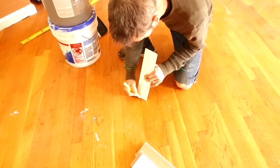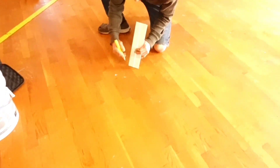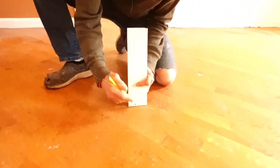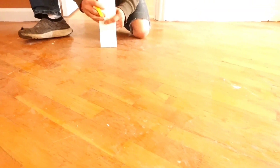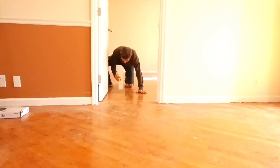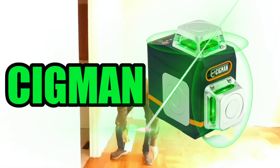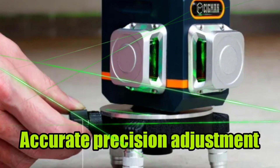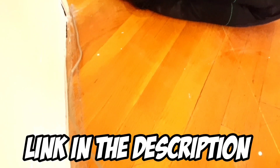I could make a crow's foot at both ends and snap a chalk line, but I don't like using chalk indoors with fresh paint — it tends to get chalk everywhere. And with a distance this long, if you don't pull your line super tight, it can have a bow-and-arrow effect and get a little off your mark in the center. This laser level does not lie and my pencil mark is super easy to see. It may take a little longer, but it's dead accurate. Special thanks to our sponsor Sigmund Laser Level. If you're in the market for a laser level, you can receive a $45 off coupon — we'll provide that in the description. I've got my control line drawn all the way down using a straight edge, and that's going to be our reference for our starting point.